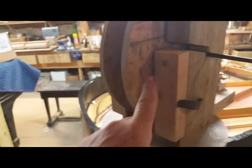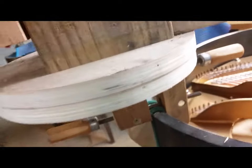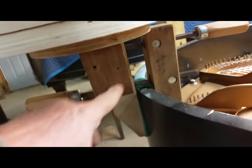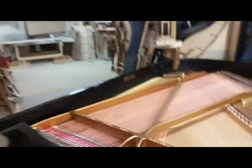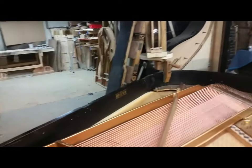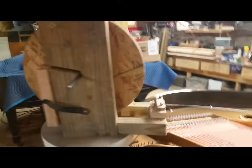This design ended up working great. I also have it designed to rotate — notice I have a double base: a permanent base attached to a wooden clamp that I can clamp to the back of a piano, felt-lined so it doesn't hurt the finish. That allows the dispenser to pivot in whatever direction I'm at when I'm stringing. So it'll move and stay true to me. A very wonderful vertical string dispenser — I hope you enjoyed this video, thank you for watching.